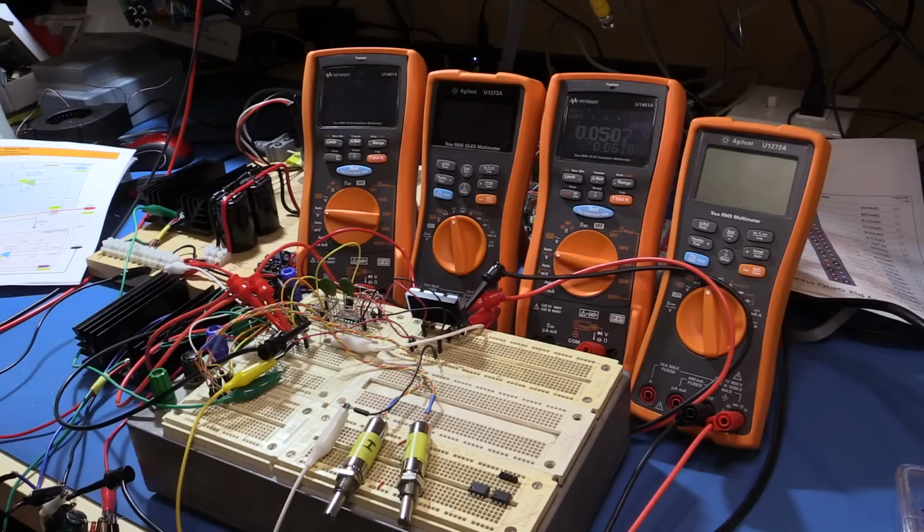In the previous videos, if you look on my YouTube channel, you will see that I've already started working on a Raspberry Pi based control panel with Windows 10 on it, and driving digital to analog, analog to digital converters, as well as relays and things. So that would be an ideal control solution for this. Now obviously, if you want to have multi-channel power supply output and also have DC load and various other things as well, then you would need to use isolators, and I've already shown how they can be used on my Raspberry Pi video for Windows 10 and other ones, where I'm using an I2C isolator that provides up to about 4,000 volts of isolation on the I2C bus from the system that you're controlling, from the actual microcontroller that's the master of the I2C. And you've also got these available for SPI bus as well. So I'm going to be using those.